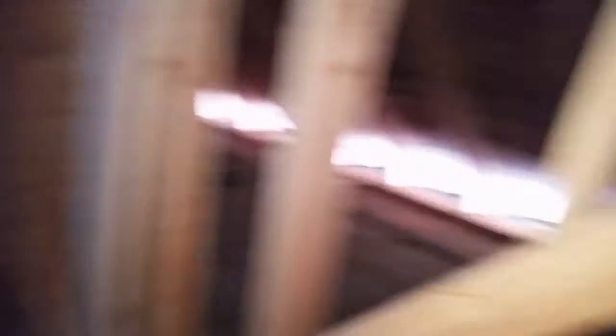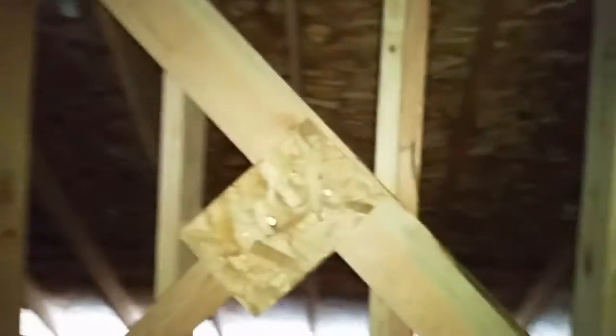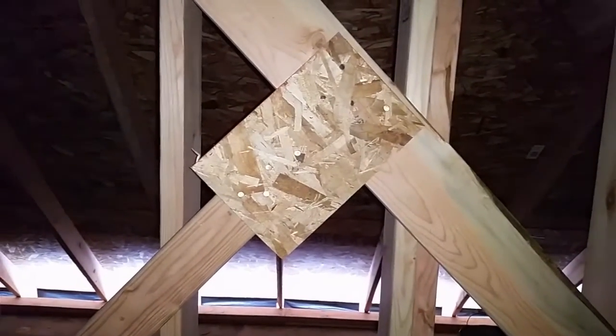I went home last night and I've built mine — I'm not using that. I'm going to use 2-inch ring shank galvanized nails. This one's going to be on the gable so I didn't gusset the exterior side, but I did bigger gussets, nicer looking gussets, using galvanized 2-inch ring shank nails. Sitting at home last night I'm thinking, man, I hope that doesn't fail. So here I am this morning back on the project, and I wanted to test something and show you guys. Their gussets are way small — they've only got 4 nails into each truss member, which in my opinion is horribly done and inadequate.